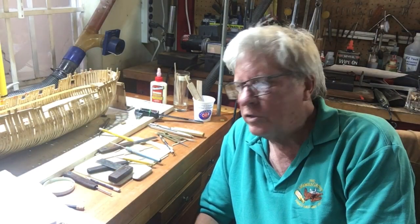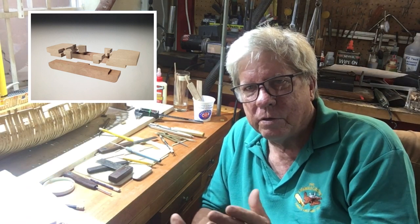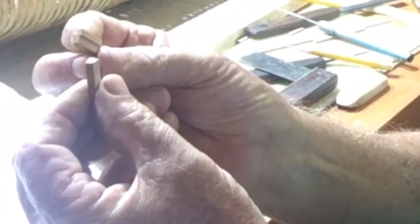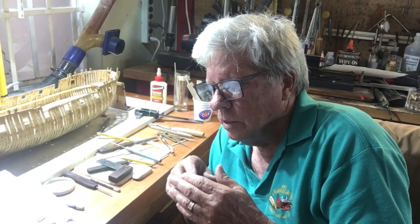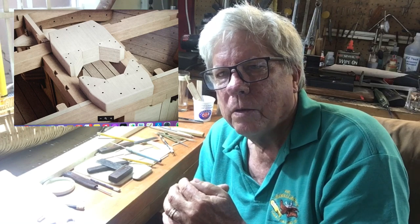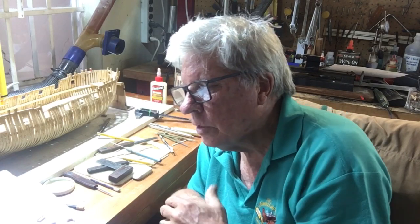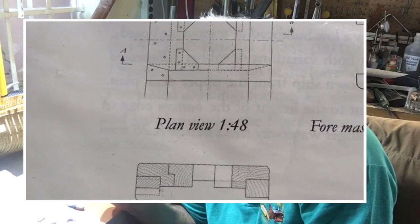The fore mast partners were a real struggle to understand from the book. The clarity that the 3D provides in understanding the piece is incredible. I spent a lot of time trying to figure out what was meant in the book, and these are the two pieces I made up based on my understanding — but these are the two pieces actually required. In a real sense you need both. Simply going to the 3D, as shown in the corner, really lets you understand the piece. But you still need to come back to the dimensions shown in the book and from that put your various lines and make up the pieces.